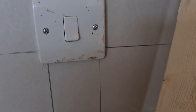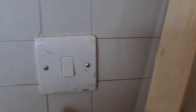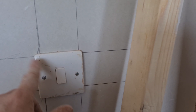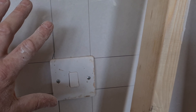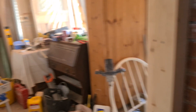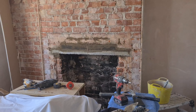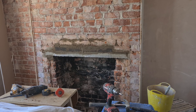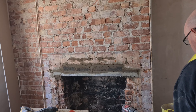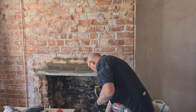We're going to fix that piece in on that side cheek and we've got one on the other side to do. This wall is all boarded now with the sockets cut out — no nasties for the sparkies. I matched this board in line with the galvanized back box and transferred the level across onto this wall so we could put the board on full and then cut out the square afterwards. The lintel's in place now — the span light is in — that's going to stop the fireplace from falling.